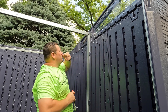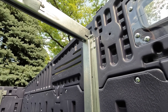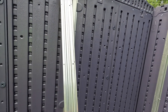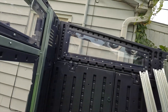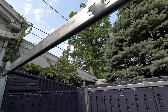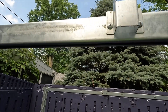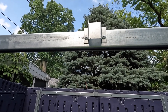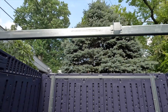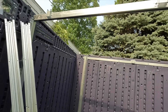We got the ridge bracket bolted on. The next step was to put channel pieces on that will guide the final metal roof framework — three of them will run from front to back, including one in the middle. One annoying step: the screws that came with the hardware were too big for the existing holes, so I had to get my drill and bore the holes out a little more. I stripped a few screws trying before I figured it out — the holes just weren't the right size.